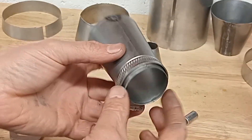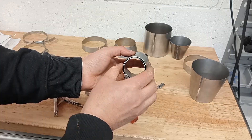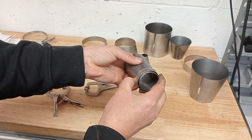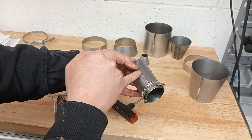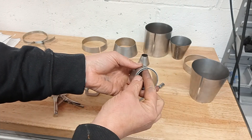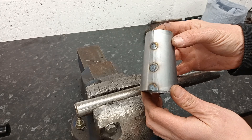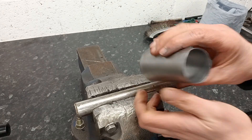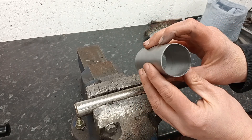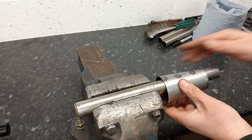The next operation is to weld these. I tend to start off tacking - probably three to five tacks - and then once I'm happy I'll give it a bit of a knock to correct any misalignment and get it perfectly flat so the two bits meet up nicely. I've spent plenty of time getting that square and when I push them together that's a pretty good fit, meaning I won't need any filler. These sections are springing apart a bit - there are a couple of ways to deal with that. I can use clamps on each end, or another way is jubilee clamps. You cut your own size and it's got a quick release fastener so that can go around there. As you tighten it up you're just trying to keep it all nicely aligned.